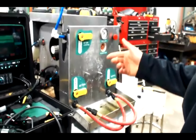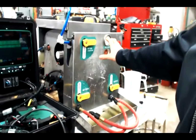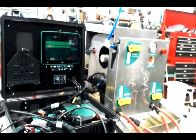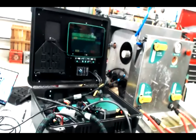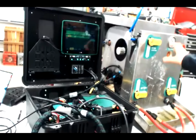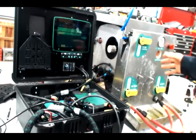If you have HDs or flow senses that you're questioning if they're operating correctly, just like we test meters in the winter, we can now test liquid to ensure full functionality before heading to the field. Prior to this mobile liquid test stand, we would have to hook your planter up to a tractor, power it up, and then do the troubleshooting on those HDs, whereas now we can do it in the shop on a workbench. So I just wanted to make you aware of those things that I have access to now as a dealer.